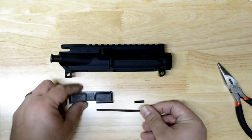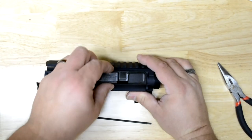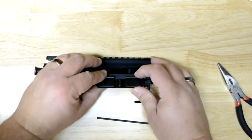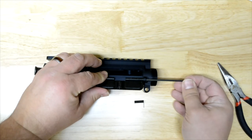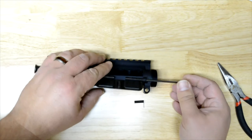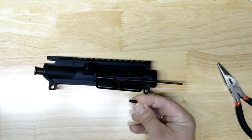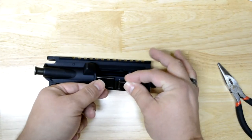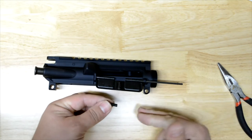Now on to the easier parts. Get your door — it just goes into place here and opens up. So put your cover in place, start the rod through almost until it goes into here — that's where your spring is going to go. The tricky part with that is your spring is going to need to be under tension, so you're going to pre-wind it and put it into place, so that way it's under constant tension and when you close the door it really wants to open back up and stay open.